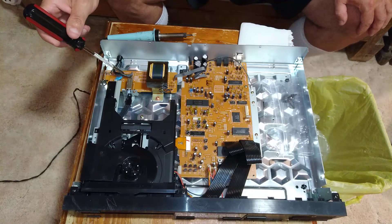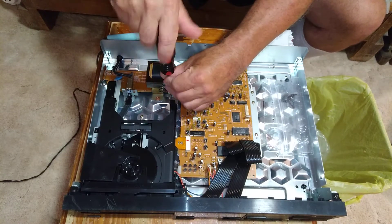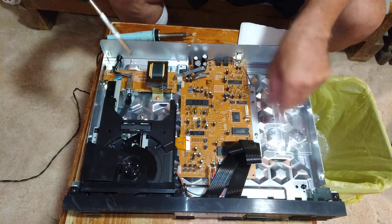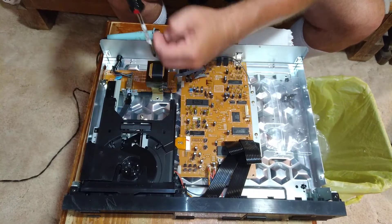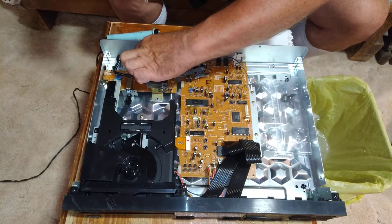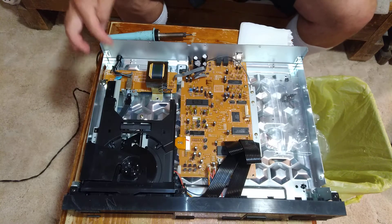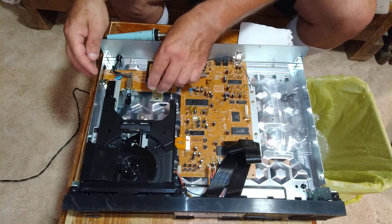This cord is not rated for 20 amps, so we're going to unscrew this. You can see the white on the cord — that's this side — so I'm going to follow this run here and see which jumper I have to take out to put the fuse in.